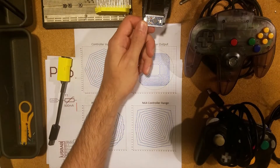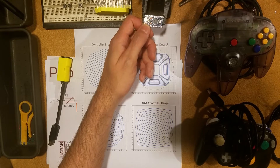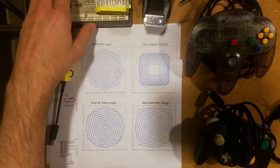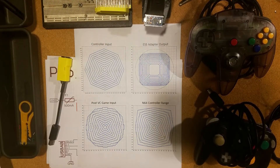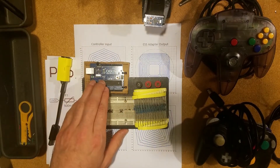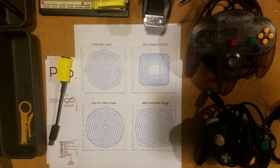To accomplish this, we're going to use an Arduino. This is a clone of a SparkFun Pro Micro, but any Arduino with 5V, 16MHz, and hardware serial should work. I have a Uno here as well — an Arduino Nano might be another choice.